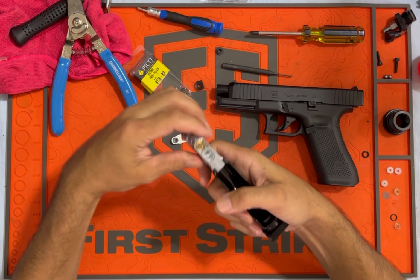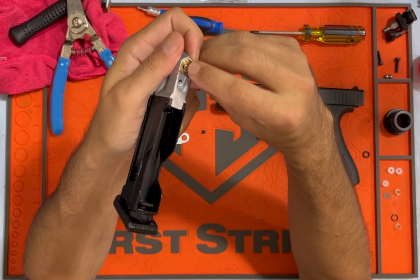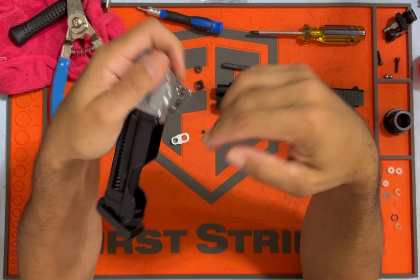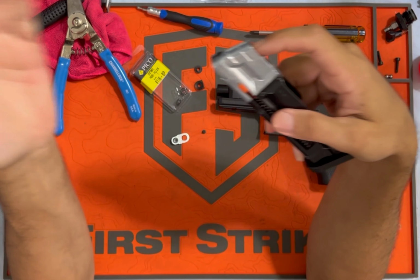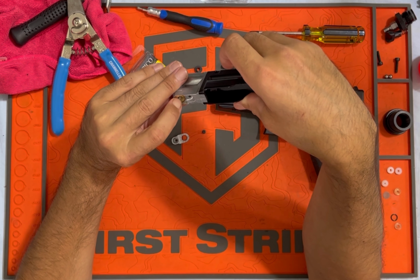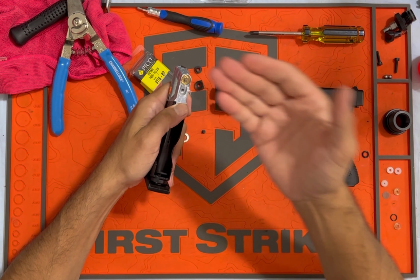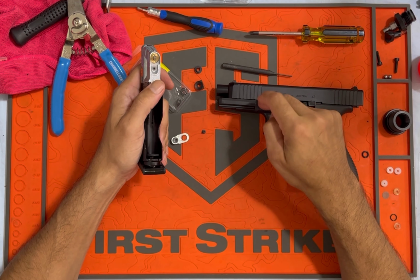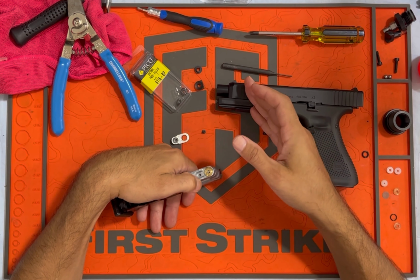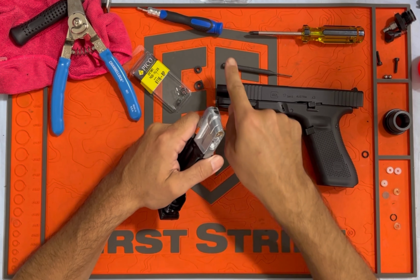And in my quest, while I was searching for this solution here, I did find some that were too tight. What happened was that when the firing pin whacked this, it just bound up and essentially blew all the gas down the barrel. So there's going to be a little bit of fiddling to try and get that right, if at all. Pending I can't block any blowback action, shimming this return spring here, recoil spring, is probably going to be the only option. But I mean, we're wasting a lot of energy out the back, so we wanted to go forward.